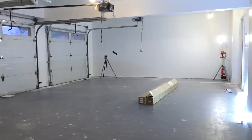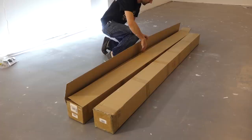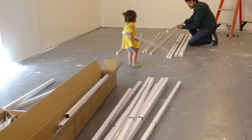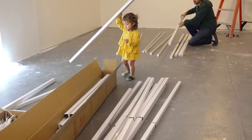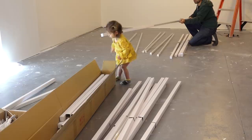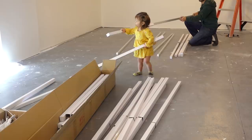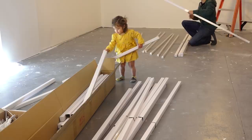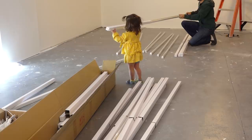Next I'm going to get into the lights because this place is super dark, and that has been the hardest thing for me so far — just being able to see what I'm doing. I'm starting out with a 12-pack of these eight-foot-long fixtures. I'm going with these mainly for ease of installation — they have a couple of clips that attach them to the ceiling and they're also linkable. These are rated for 72 watts and have a color temperature of 6,000 K — a daylight balance, which gives a nice bright, natural outdoorsy-looking light.